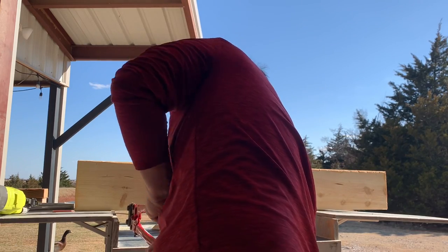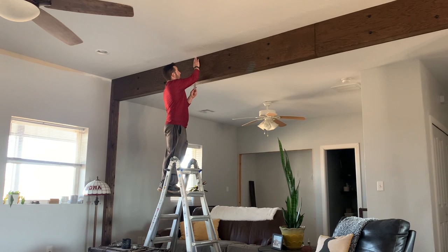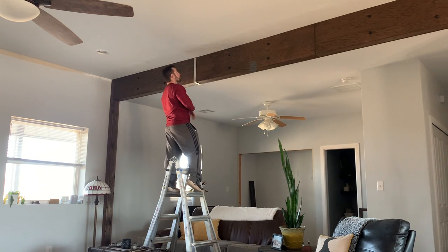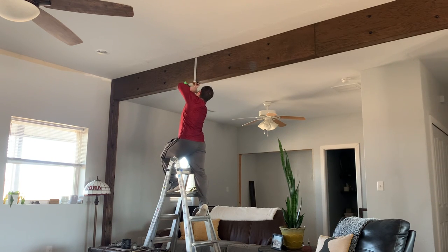It's easiest to cut this flexible metal with bolt cutters — and don't hit yourself in the face. I measured the front, bottom, and back dimensions and cut the strip to that total length. Then I put it up and bend it around the bottom and around the back — it should be the perfect length. The front was 14 inches, the middle about 5 inches, the back about 2 inches; just add those up and that's what you cut it to. The 1/16-inch metal is pretty foldable and workable.